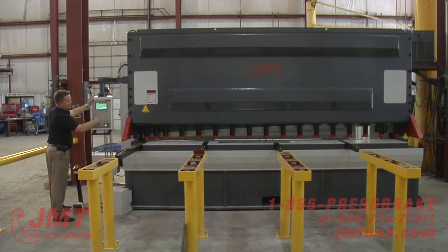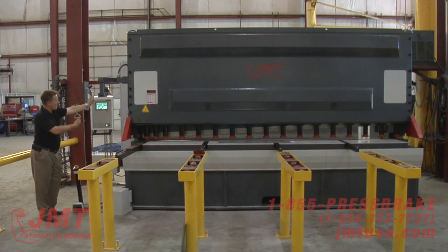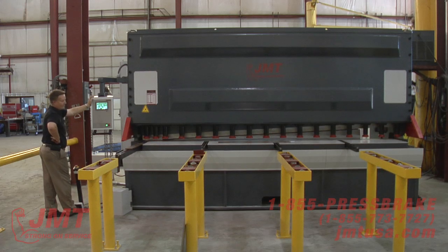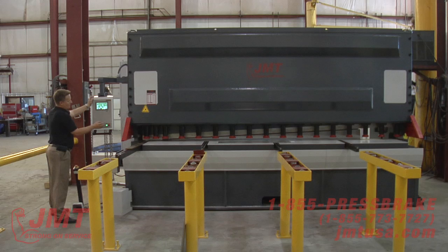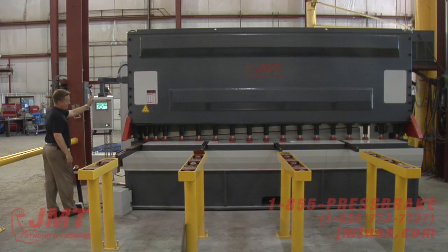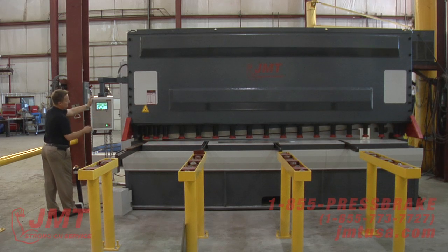I've also got my length here at 120 inches. Let's say I'm going to shear a piece at 24 inches — that's going to be my length. I don't want my back gauge at 12 inches; I want it at two inches. My back gauge is coming into two inches. I'm going to shear 24 inches. On my back gauge, I can set a retract — say 0.1. So as soon as the hold downs touch the material, my back gauge is going to retract 0.1, then come back to position so I don't trap my blank or my drop.